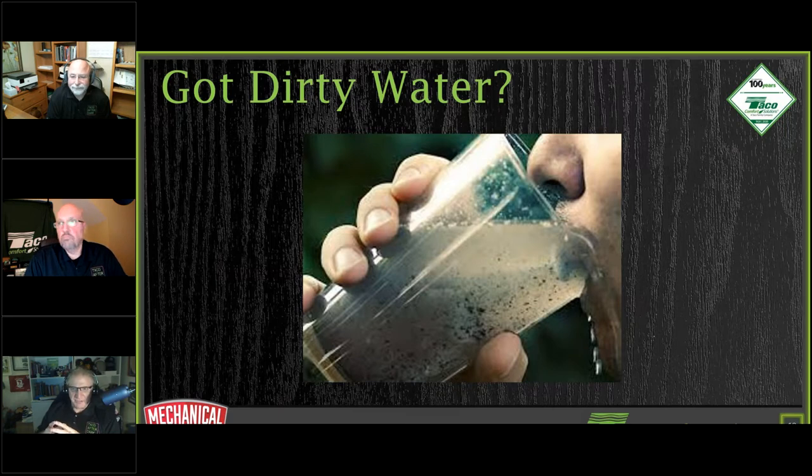And a question from Bill D'Agostino: if you have a Taco low-loss header, do you need to add another air separator, or will that do a good enough job removing the air? That's a really good question. The hydro separator is just that, a hydraulic separator. It is not doing any air removal. Yes, we put an air vent on the top to collect any air that may accumulate in there, but there is no collision media in there. So you are going to look at having your separate air eliminator, if you wanted to put a 4900 in front of that, or even on either side sometimes too.